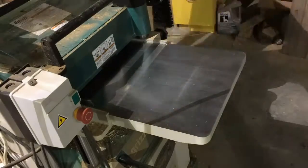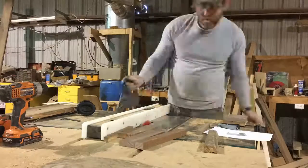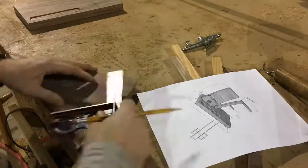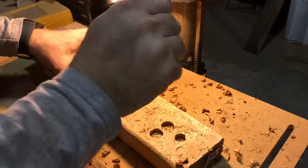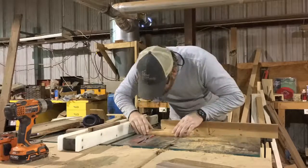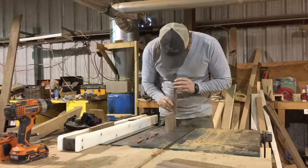At this point, the barnwood base is on the CNC machine getting cut, and I'm just finishing up building the phone stand portion of the catch-all table, as well as the watch stand. The phone stand, I cut at about a 15-degree angle, so it's not just sitting at 90 degrees. And then I drill a hole so you can run your charger through. I also had to go back and put in a dado in the phone stand, and I built a little shelf essentially that'll fit in that dado, so that the phone can have something to sit on.